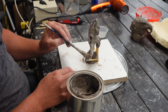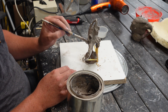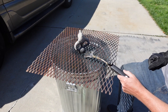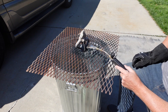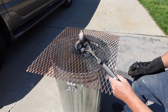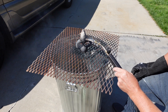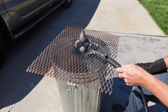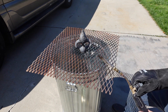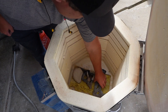This is kind of a small piece for my product, right about there. Should I cast it in investment or just do it with my product here — with Hellfire. Once you've cured out the piece, let it sit and dry for a few days. Come back with a torch and slowly burn out the wax. Then once the wax is all burned out, stick it in a kiln and bring it up to temperature to really cure out the ceramic and get it ready for casting.